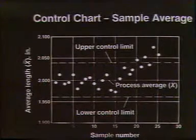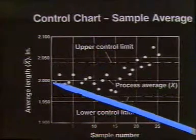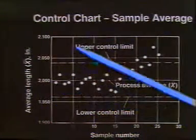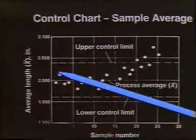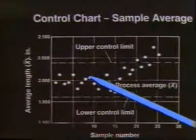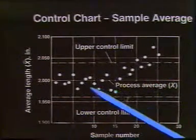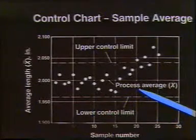If we're taking a measurement, in this particular case we're taking a bar of metal and trying to saw it into 2-inch lengths, exactly 2-inch lengths. And we're going to have a control chart that's going to give us some idea of how close we are coming. In a sample that we may have, for each one we're going to have the length of the bar, and it isn't going to be exactly 2 inches. It's going to be higher or lower than this. And within that particular frame, we're going to have an average. If we take the next sample, it may have 5 units in it, and it will have different values, and within that, we will have an average. And of course, this happens for every sample that we take, and we may have a big spread in this, and then we can take an average of all of the sample lots that we took, and we can put a line through it and get the process average if we want to.